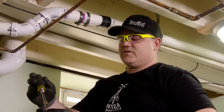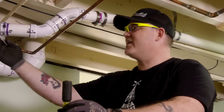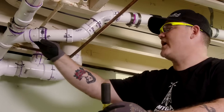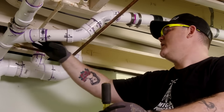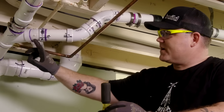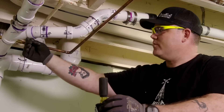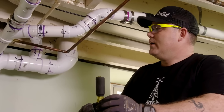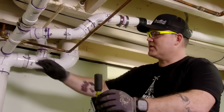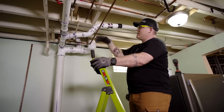I've got it undone — you just use a 5/16 driver. Next, I'm actually going to be cutting out this street 22-and-a-half-degree offset fitting from this two-inch PVC Y. I'm going to remove the section of pipe that's inside the hub with a special tool so that we can reuse it — we don't have to cut back any further. This is going to be our starting point and our ending point. We're going to straighten this all out so it's the right angle.